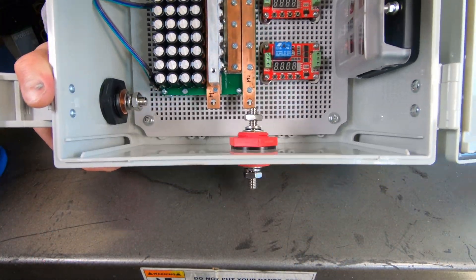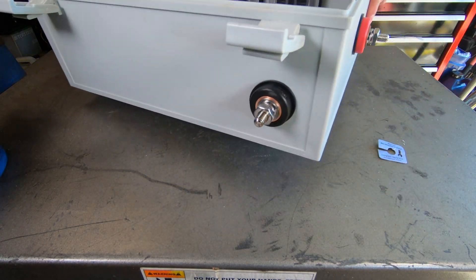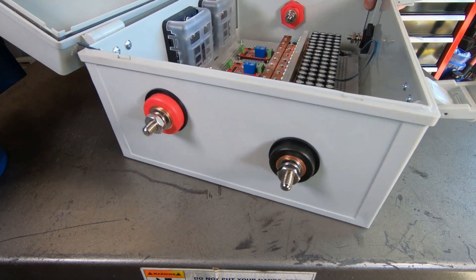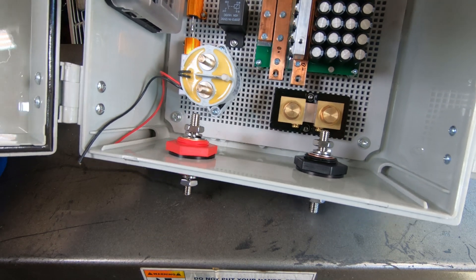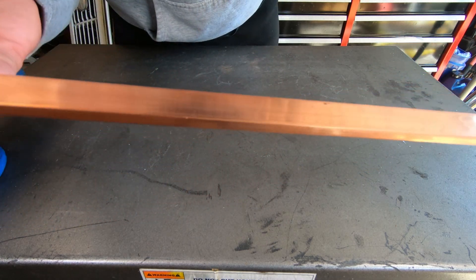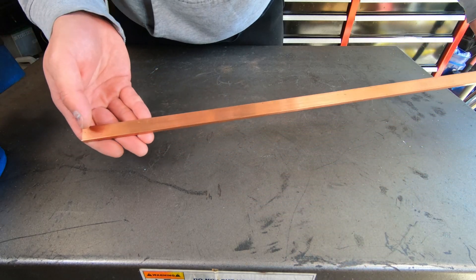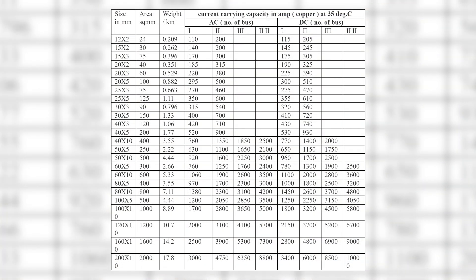The pair of terminals on the right are the motor output terminals and the terminals on the left are the battery input terminals. The bus bars on the PWM control board have been marked to avoid mistakes. For the copper bus bars I'm using three-quarter inch wide by one-eighth inch thick C110 grade copper rectangular stock — not the best copper grade, but it was available in my area.